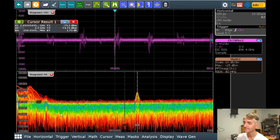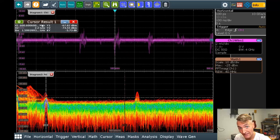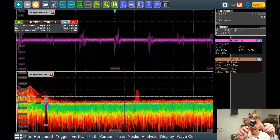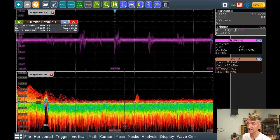But down here, we have some more exciting things happening. So I have something right here. So what's this spike right here? I bet it's 600 megahertz. Guess what is sitting at 600 megahertz? We've talked about it before, but I use these little wireless microphone transmitters, and right now my channel is 600.15 megahertz. So that spike that we're looking at right there, if I move my transmitter over, look, boom.